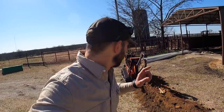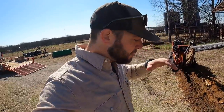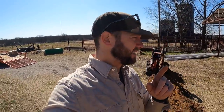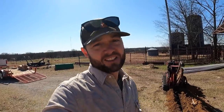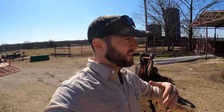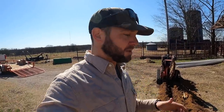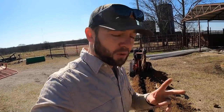That will probably be my biggest holdup with this guy — the rock here. You get about a foot and a half below the topsoil and that's where the rocks really start, so it depends on what I run into. I'm going to go at least two feet deep on this — that's my goal. In Oklahoma it only has to be 18 inches deep for water lines, but with the recent winter blast that Oklahoma and Texas went through and all the problems it caused, we're going to go at least two feet just to be safe.